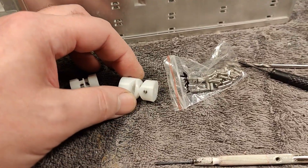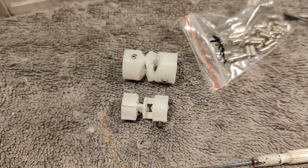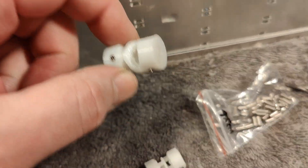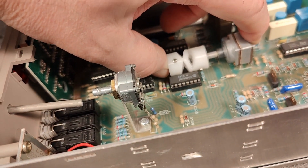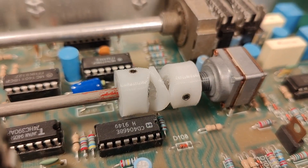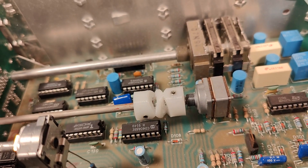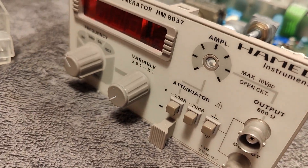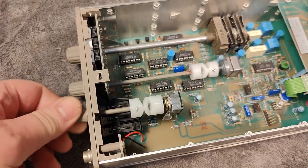Here is the fantastic part I 3D printed. I upped the length of the set screw section to 6 mm instead of 4, so I got more material. The diameter fits pretty well when I stick it onto the potentiometer shaft — there is a whole millimeter of safe distance, and that is exactly what I wanted. Here it is screwed in perfectly, all the safe distances look nice, and the start and stop position of the knob is perfectly aligned. It runs smooth.